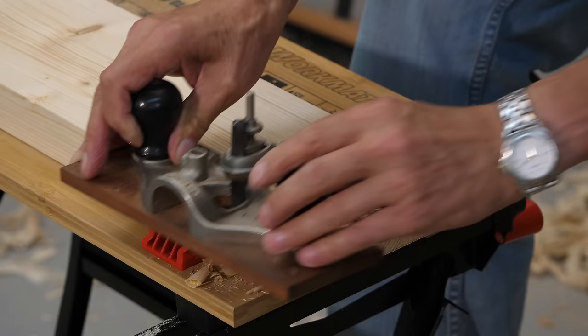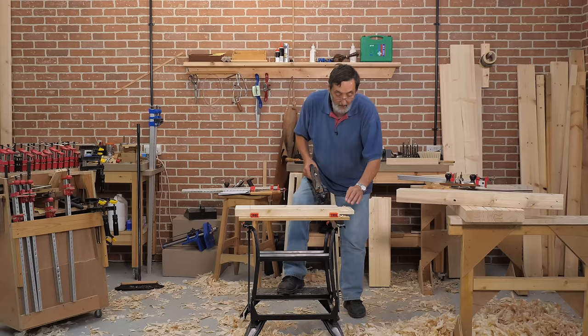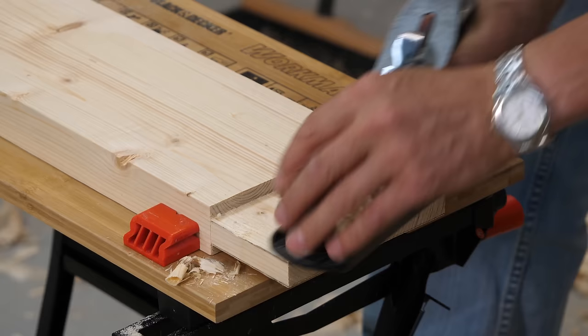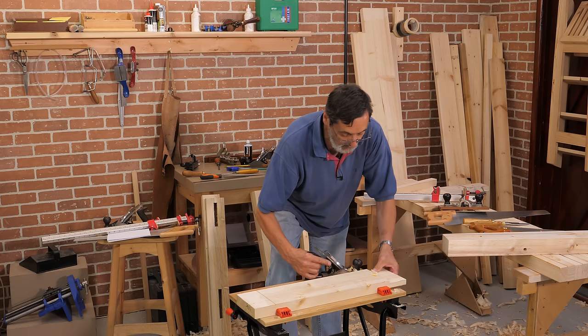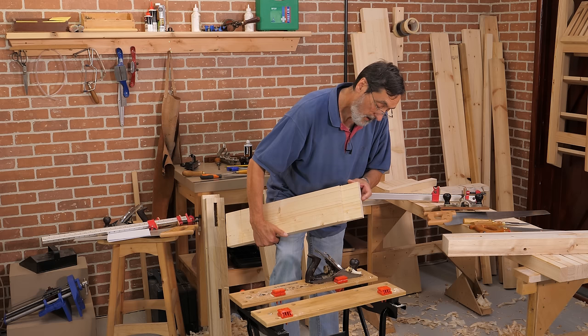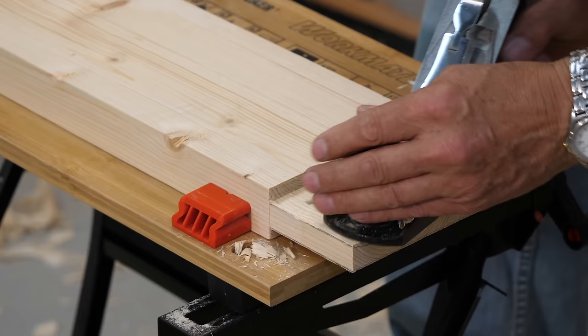When you get to this outside section here, you may want to go just with your smoothing plane, like this. Then use your gauge lines to follow. So just take your plane now, because this is down, this outside rim of the plane is free to get down to your gauge line. This is very smooth. Now, there's my line on this side. I'm slightly out of parallel, so I'm going to go back into here and take down this far side here, this side down.